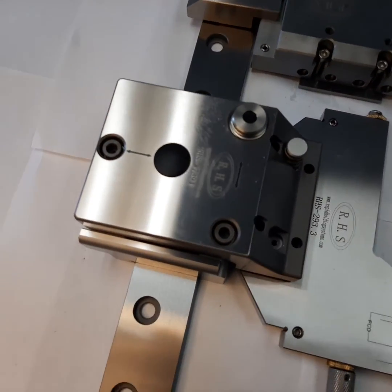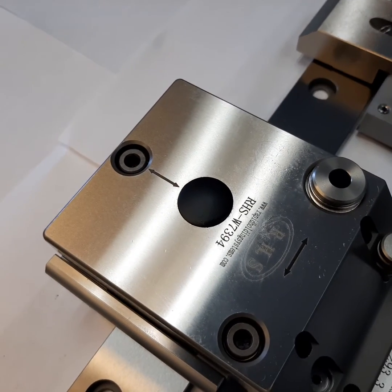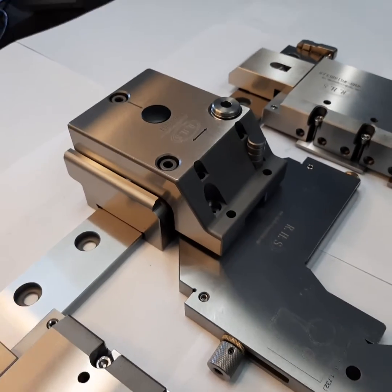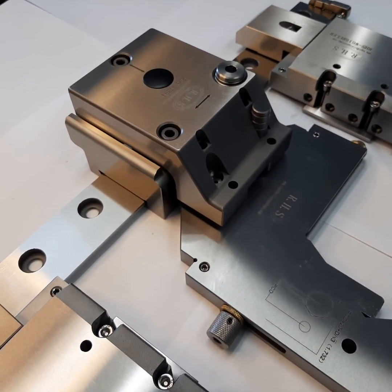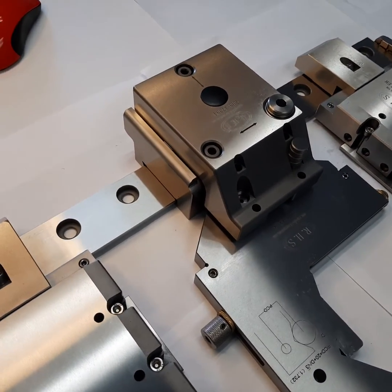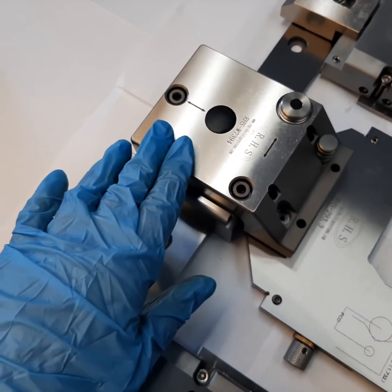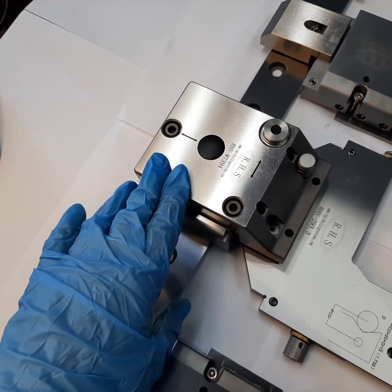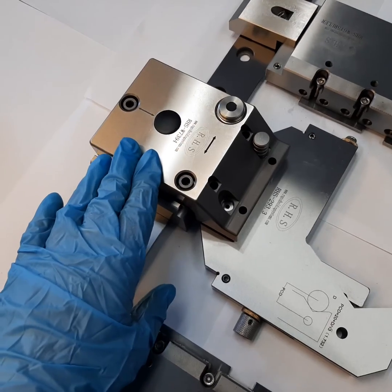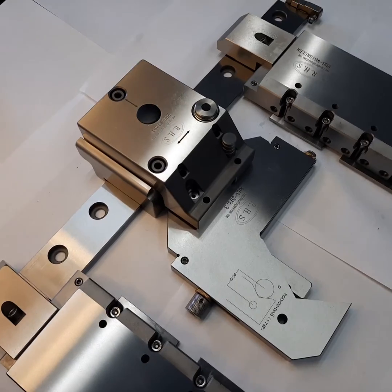I'm having here a mounting adapter. Our RHS part number is RHS-W7394. This mounting adapter is compatible to system 3R-272 HP. Mount directly on the reference elements. This one is adjustable in 3 axes. We are also having a fixed one which will be compatible to 3R-226.4. This one is used for manually clamping the SuperVices, holders, etc.